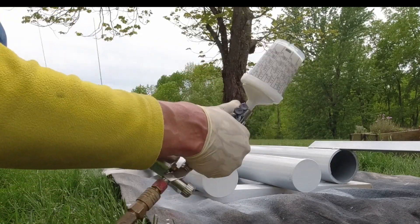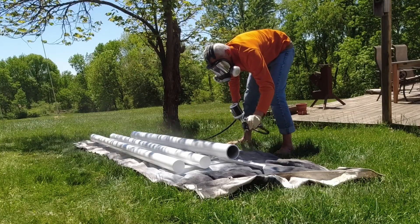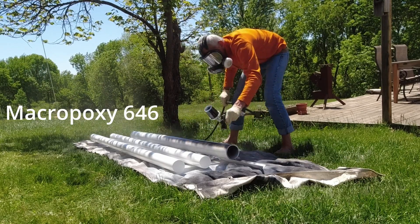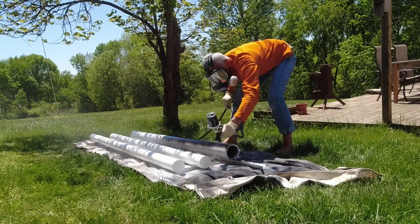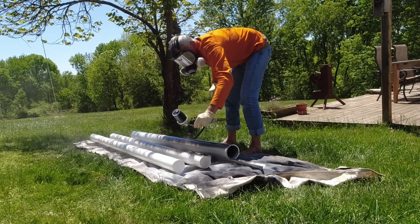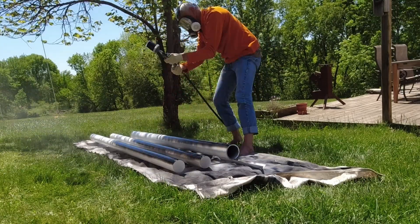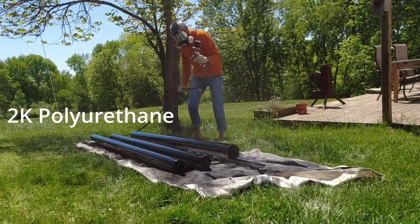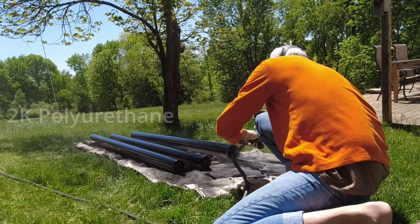You want to paint these — here you can see me use epoxy primer to put down onto the bare steel for corrosion protection. It's a two component epoxy primer, a professional paint with good adhesion to steel. Here you see me put the first coat of black two component urethane topcoat on it in low gloss black. It looks glossy when you paint it at first but in the end it dies down and has a semi-gloss finish, which looks pretty good.